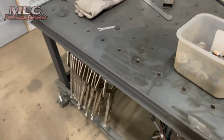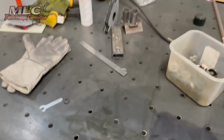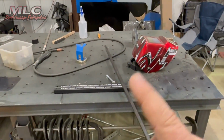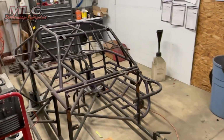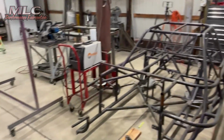And I was wanting to get a video of building it. It's a 3/8 top plate with 5/8 holes on a 4-inch grid. I got another one to build. So when we go to build the second table, that is going to be a video because it is going with this table end for end. So I have 4 foot by 16 foot of jig table. And that is where Mr. Pierce Modified is going to come in.